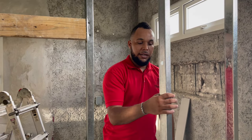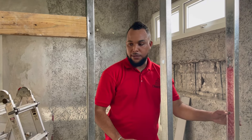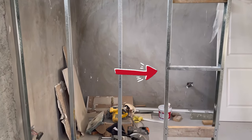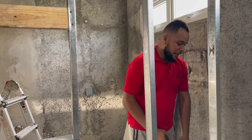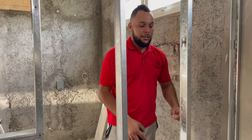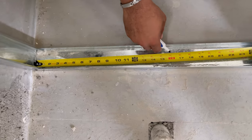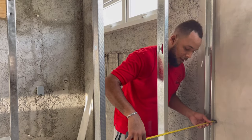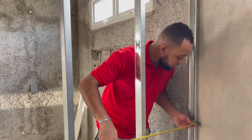They are a little wobbly now, but they get full strength once the drywall is affixed to them. On this side we put additional reinforcements because we're going to have things hung here. We used both 2x4s and track to add that support. Because we're going to be putting tile on this side of the wall with cement board or concrete board, which is very heavy, you want to ensure that the stud spacing is as close as possible. We used 16 inches between each of our studs, and the 16 inches is on center — meaning from the middle of one stud to the middle of the next stud should be roughly 16 inches.